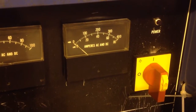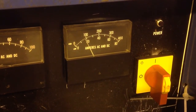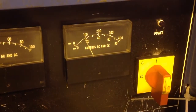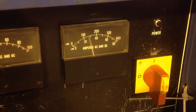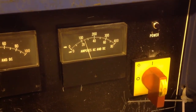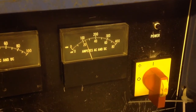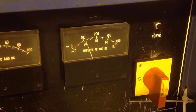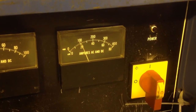Okay, just going to press the pedal. There, I've actually got a reverse pulse. As I increase the pedal, I've got a positive pulse, which is where we should be, and pedal all the way, about 60-65 amps. Again, the confusing thing there: with the pedal set the same as the background, I've got no pulse, and there I've got an inverse pulse.